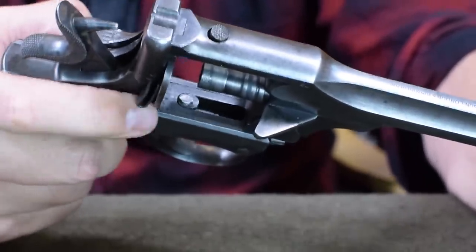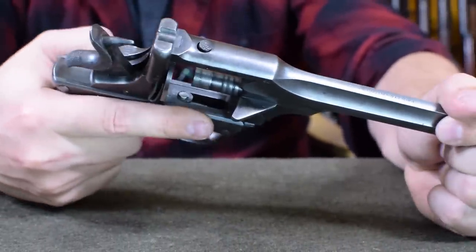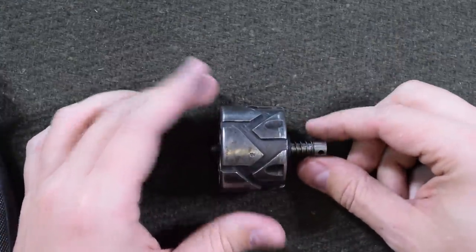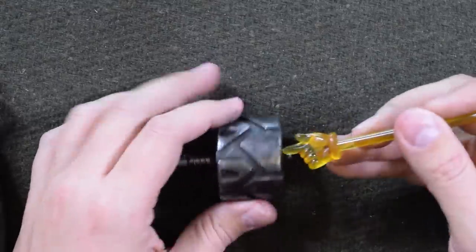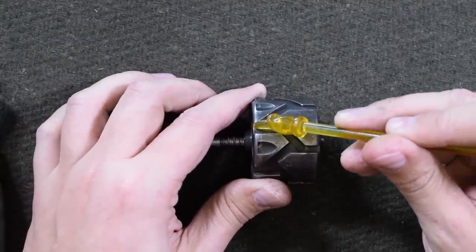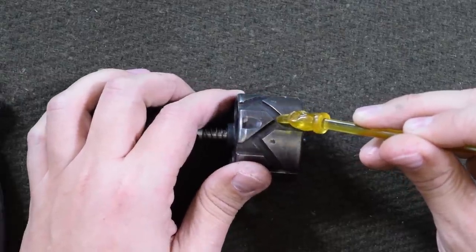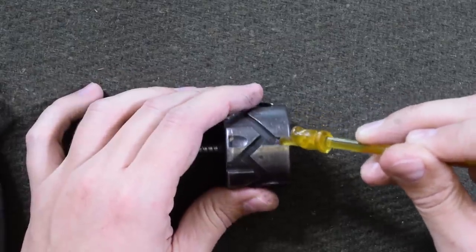And what that causes is like an inverted back and forth motion. So while that's static, this is moving, everything's in relation to each other. So ultimately this little spud is being drawn in and out of the grooves of this cylinder. So if you imagine my patented plastic and pokey is the cylinder, actually I'd be turned this way with the front of the gun that way. The spud's here, we fire the gun, boom, we hit this wall, it biases this way, recoils all the way, the spring returns it forward, hits that wall, and boom, that's our lock position. So this becomes the anti-rotation device when we're forward.